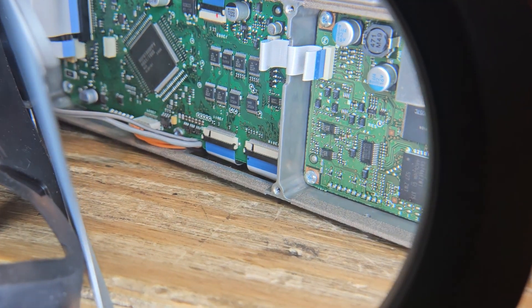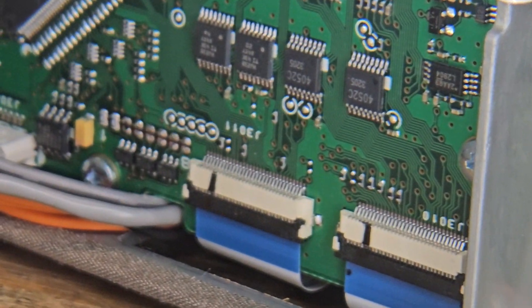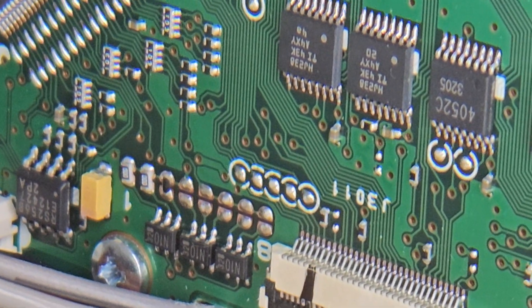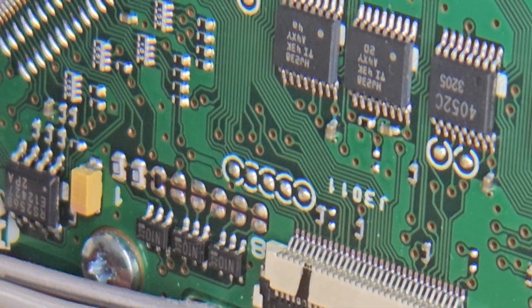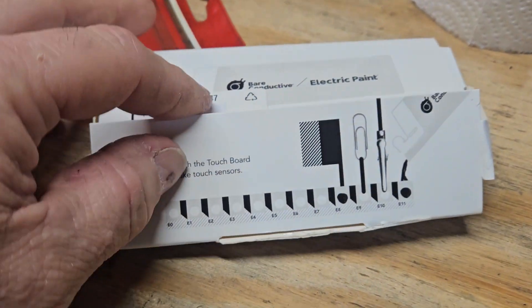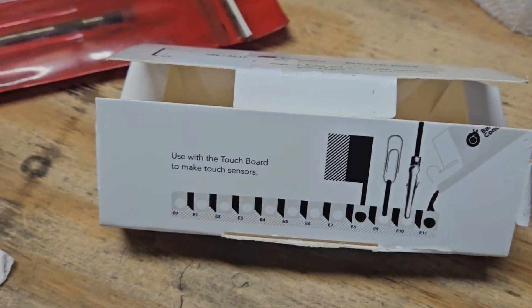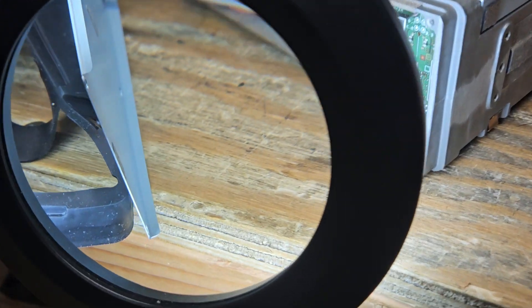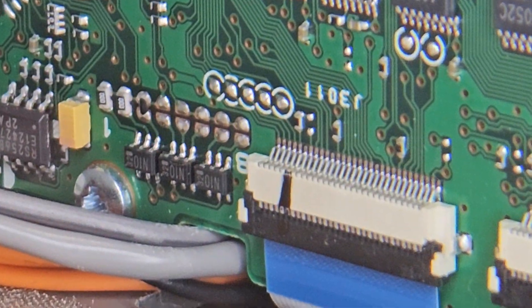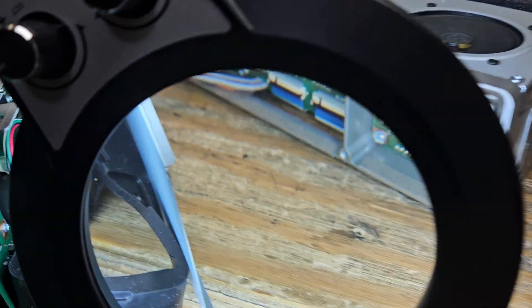Here's a MARS mod on an FT-991A. You can see that third resistor from the left — there's a little black dab on there. That little black dab of goo is conductive paint, got it off Amazon, wasn't all that expensive. You don't have to worry about melting anything. If you get too big of a gob or something, that's fine — it comes right off with a Q-tip. Just wet a Q-tip or lick it with your tongue or something, wipe the goo off the board and do it again.